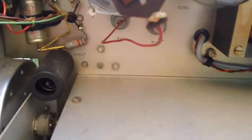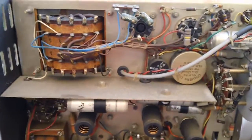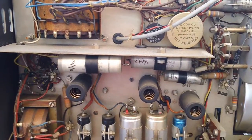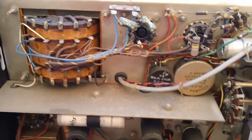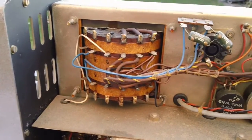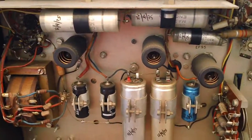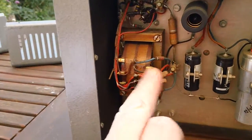But yeah, I love this old stuff. Let's swing it round and have a look at the interesting side — it's a bit of a lump. I'd seen one of these in pictures, and a lot of the test equipment I have upstairs says to be serviced by one of these TF1101 RC oscillators, so I thought I'd love to get one. Now I've got one I didn't realise how big they were. That's the other side of the mains transformer — this is the secondary with all the HT and heater connections, centre tap there. This must be the output transformer.